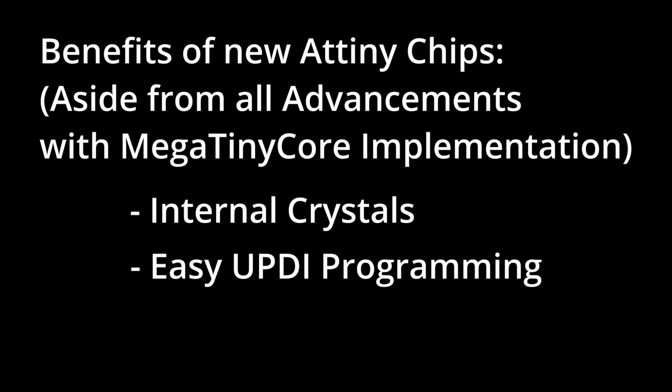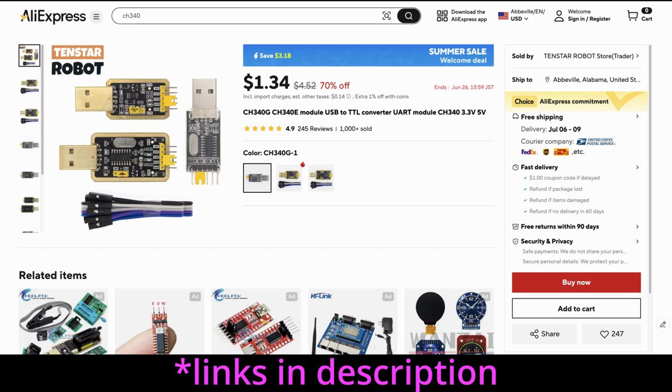And yeah, it's not as easy as the S3s that have the USB stuff built in, and you are able to program the old Atmel chips with an FTDI board, but the new programmers are dirt cheap at like $3. And you can program these things with an old Arduino board, but support is limited, so I recommend just buying the cheap programmer. And buy 2 if you want to use the serial print and all that.